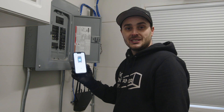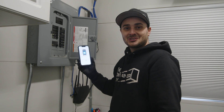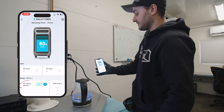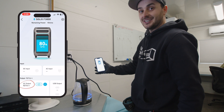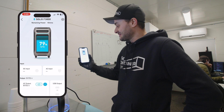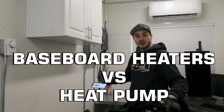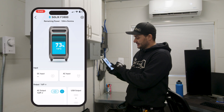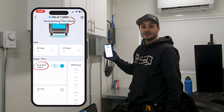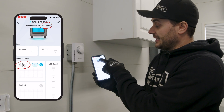For a power outage we could be intelligent and turn off some of the heaters — we don't need all these BTUs in here. Maybe we'll try turning on the kettle while we've got all this going. We're at 81% now. The kettle I think was pulling 1,000 watts — oh yeah, 5,216 watts! That's a ton coming out of that 25-amp rated twist lock. With all baseboard heaters off, I'm only using 167 watts and it's saying 10 hours and 42 minutes remaining. When I turn on the electric baseboard heaters I'm pulling 1,580 watts with only an hour and 20 minutes left.